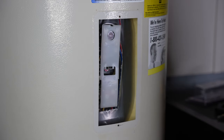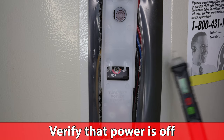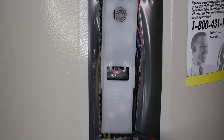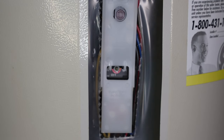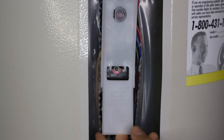There we see our thermostat. From years of experience, I've gotten used to checking to make sure the power is indeed off — I use a voltage detector or voltage pen, or you could use a meter — just to make sure the power really is off. I've had times before where I turned the breaker off and everything was still on, so you've got to be careful.